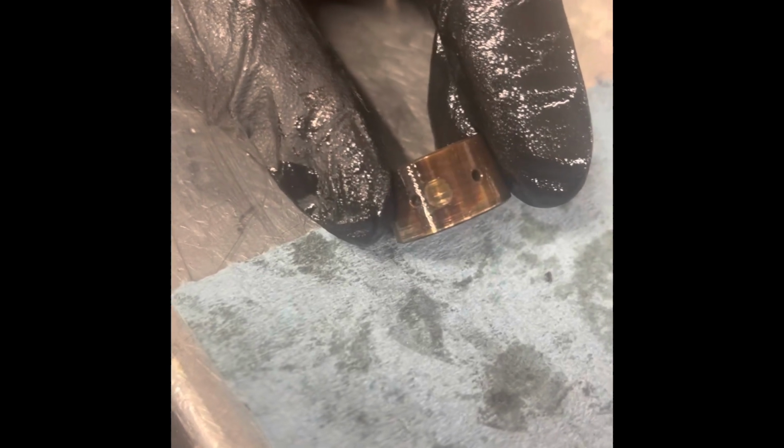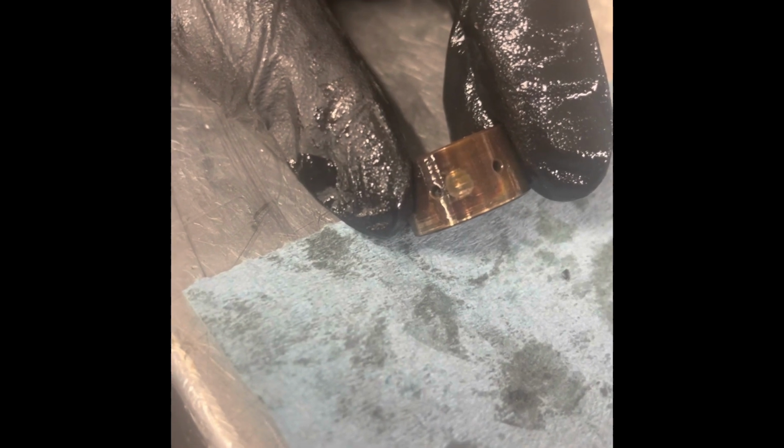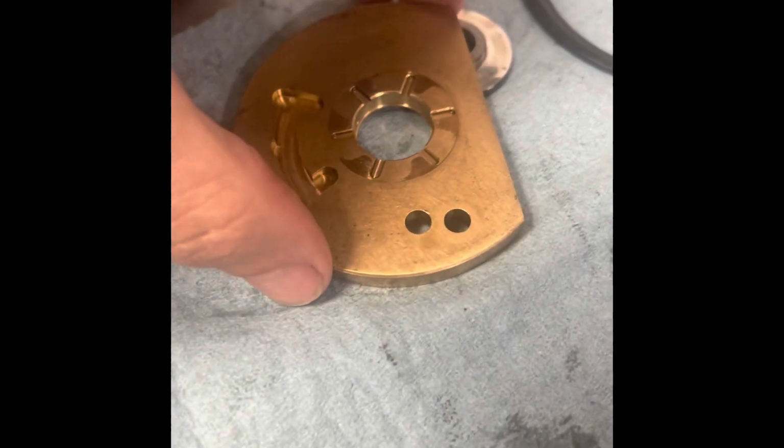And once the bearing swells up, the bearing deforms into the oil feed hole. So that's a high spot, and it stopped the bearing from turning. But it was all a cascade failure from contaminants causing that. That's a front bearing failure, but it's because something fell into it on installation. Sometimes you'll see that leftover contamination going through and getting lodged in the thrust bearing feed side.